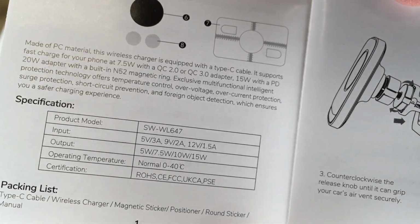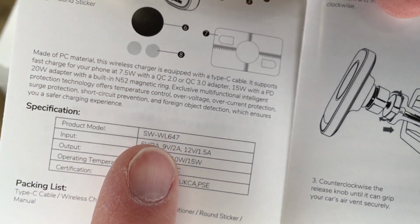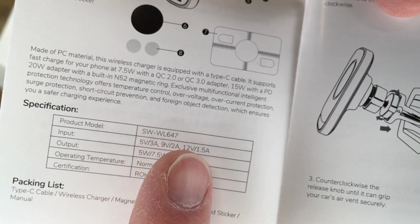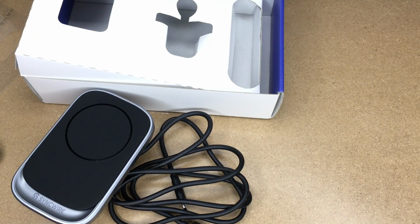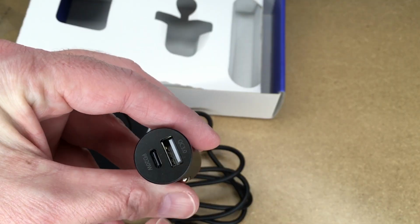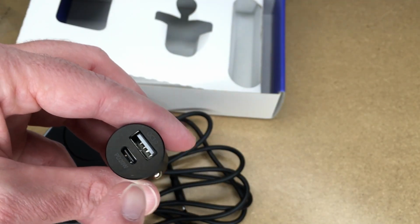So as we saw in the specs here, it does require input of 5 volts at 3 amps, 9 volts at 2 amps, or 12 volts at 1.5 amps. So this may not be compatible with the USB port that may be in your car, so you'd want to use something like this. This is a 20 watt car charger, so I'll put a link below to this also.